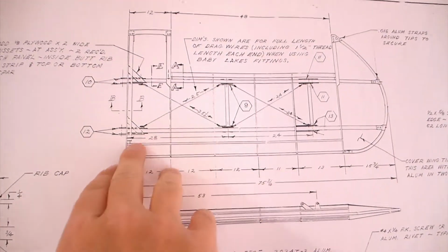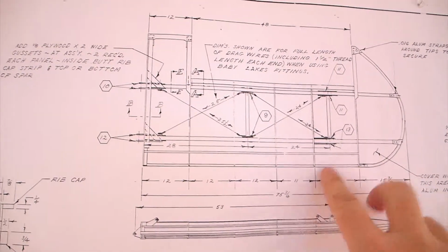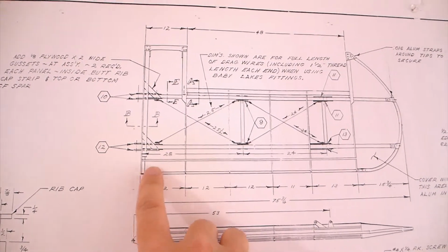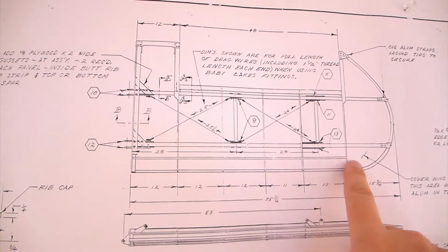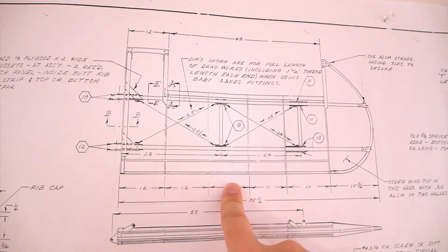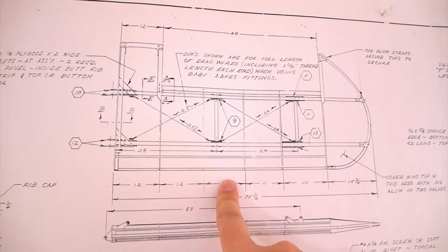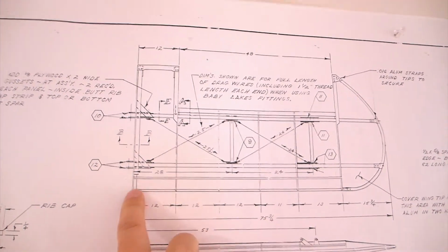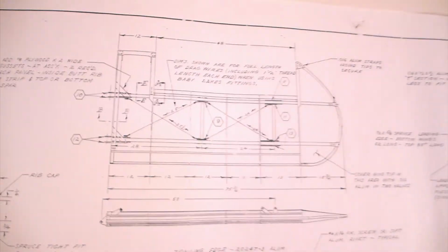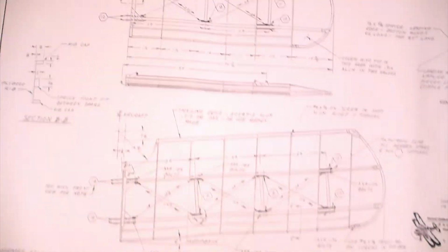And you can see this wing is straight. So I just made those 6 cuts, and the cut is square to the nose rib. Then I'll have cuts on the top and the bottom of each rib, but a shallower cut. And those will be straight cuts as well, because again, this wing is square. It's not swept. Here's the trick.